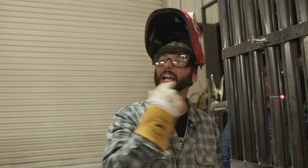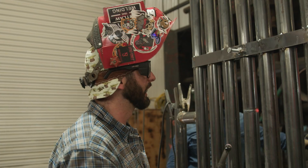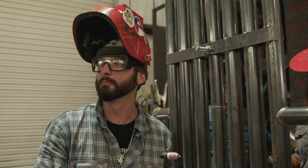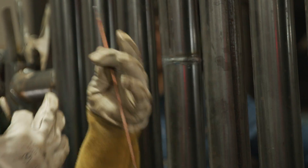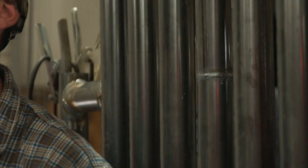He can't see that last tie-in, but I can — so I've got to be talking to him. You don't have to do it like that either: if you reach as far over as you can, past that side, you can weld towards the center. That's what we're going to do for the cap — he'll weld a quarter, I'll weld a quarter, he'll weld a quarter. We don't have to do as much communicating, and it's really a lot easier.